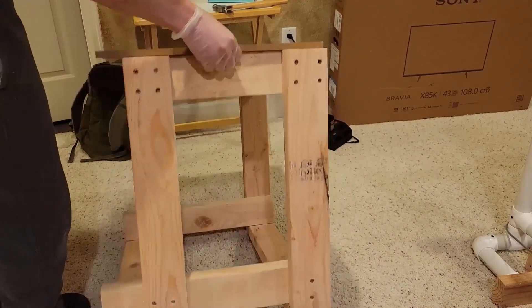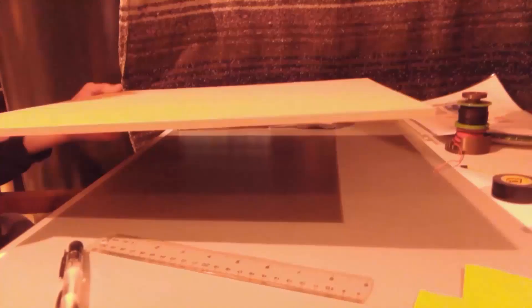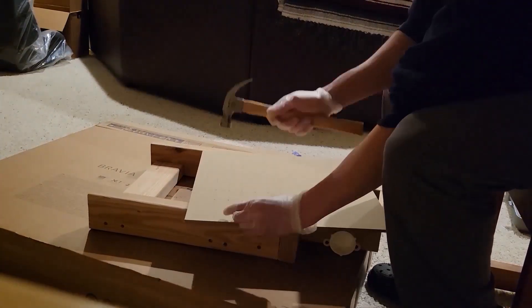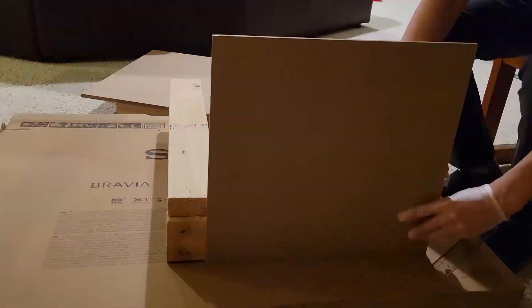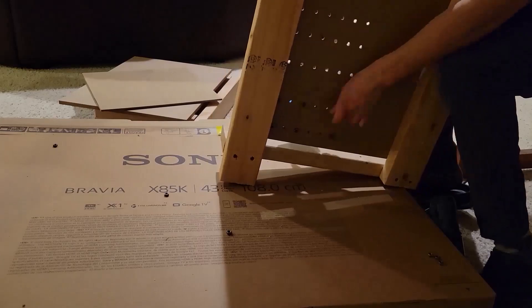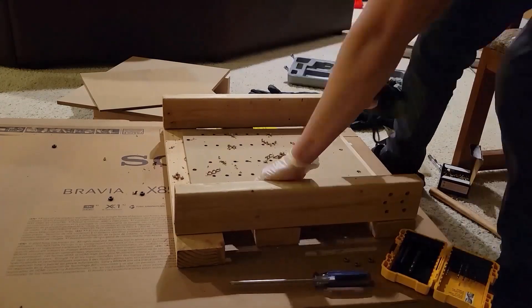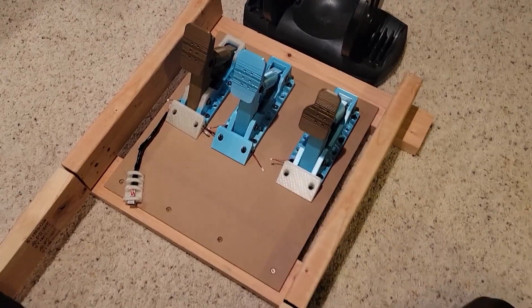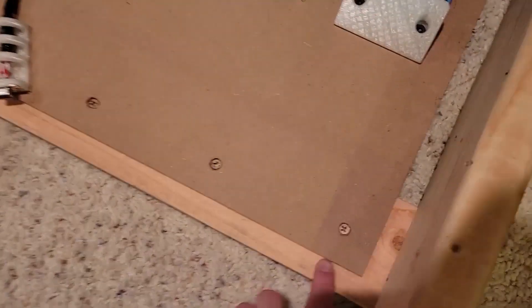And there we have a completed wheel base. When I get around to making my own wheel, I will go ahead and drill into the MDF at the appropriate locations, but for now it's fine as is. For the pedal base, I started with a ¼-inch thick piece of MDF. I marked out all of the hole locations I need for my pedal design, drilled all the holes, and started building the frame. It's a pretty simple design, so I won't get into too much detail. One thing to note is that the pedal base will slide inside the larger wheel base frame, so it's important to make sure your construction will fit. And here we have it completed, with my own pedals installed. I made sure to depress all of the screw heads, as this area will be frequented by socked feet.